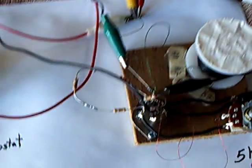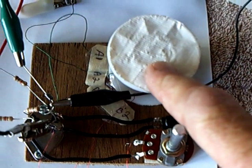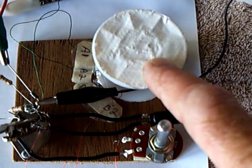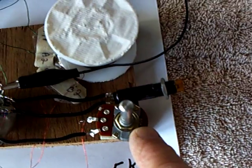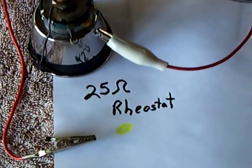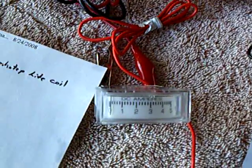It's being run by this oscillator — this is a breadboarded situation here. I've got a bifilar coil, exactly like I use in my lid motor SSG Bedinis. This is the transistor, and this was the addition I did: the 5K pot instead of a 2K resistor, and the 25 ohm rheostat at the very input voltage to the system. I can get it to do two different lights, and it does charge. That's the charge battery right there, and there's the drive battery. There's the ammeter — it shows the amp draw on it.